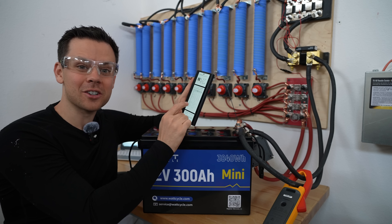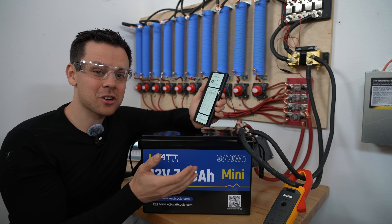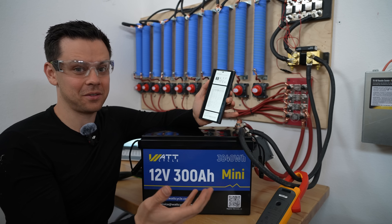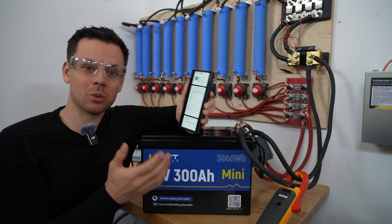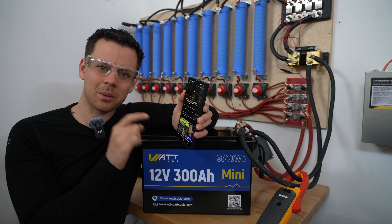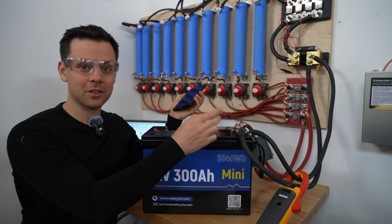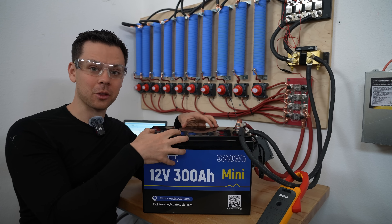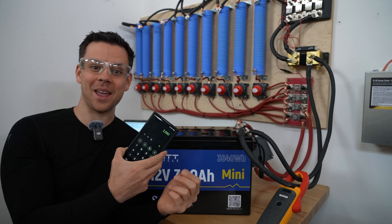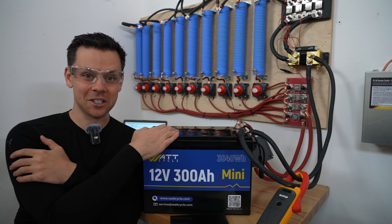The smaller WattCycle is set to 300 amps, so I trip it every time with this resistor bank — but not with this battery. 850 amps is more than what these cables can handle, so even with a dead short it could cause a fire. This is very common with these 12-volt batteries. The Seacon had the same problem. If you buy these budget batteries, put a fuse on every single one. If you put three of these in parallel, that's 2,550 amps — please add a fuse.